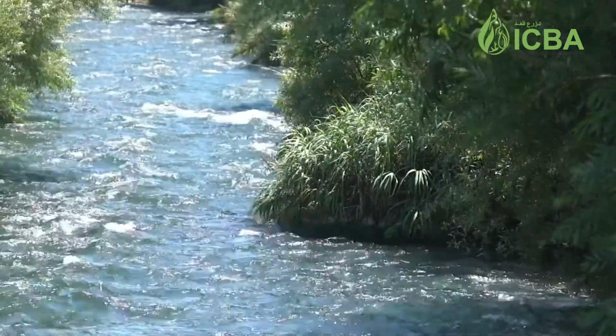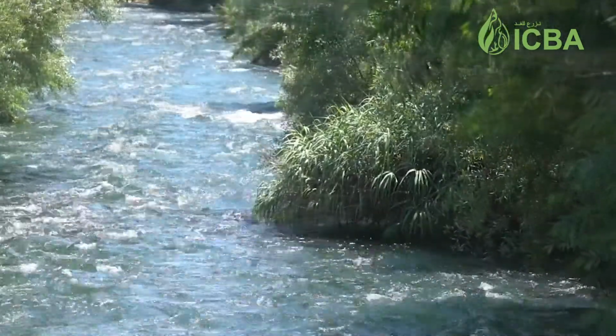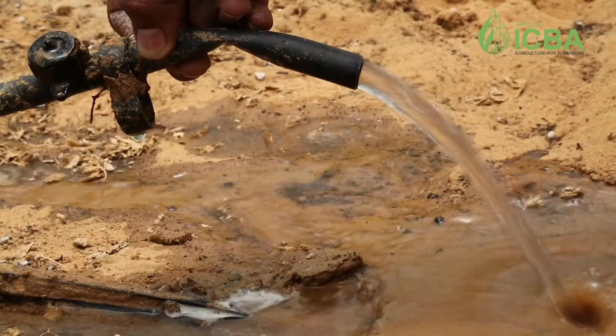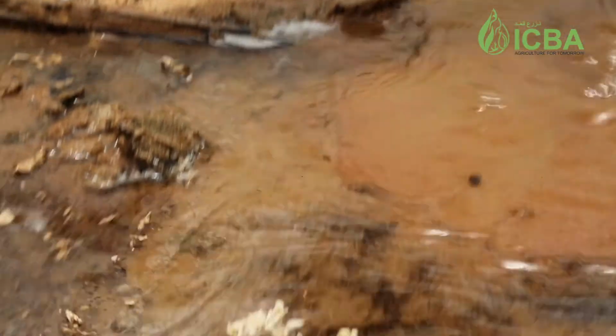If you are working with surface water, for example getting water from the canal, canal water usually has some suspended material, some silt or other things. To be efficient, it would be advisable when you are closing the system to flush it for 1-2 minutes, so that if anything is stuck in the pipes, it does not get stuck permanently after you leave it overnight.